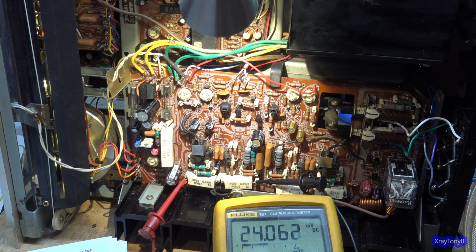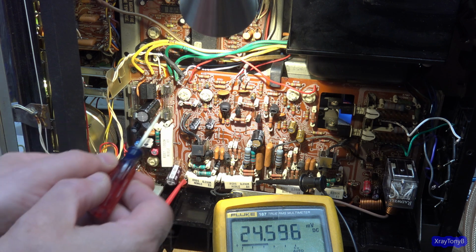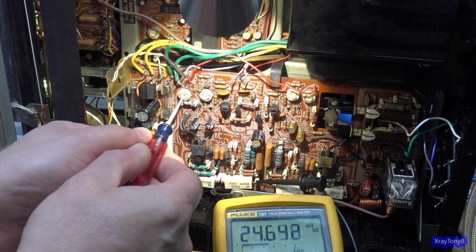And we didn't measure it with a scope. But I have a feeling if you did some critical listening, you may be able to hear a little bit. I don't know. That was kind of low. But I would think if this was idling at about 10 to 12 millivolts, which is half of what they're recommending, it would probably work just fine. These transistors seem to be pretty good. And again, see, it's creeping up.